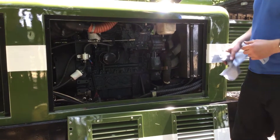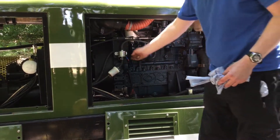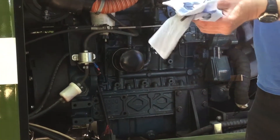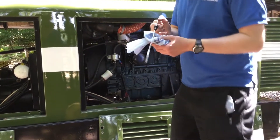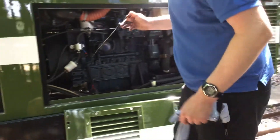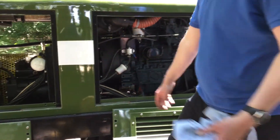Now we're on the left-hand side of the loco in the direction of travel. A bit more to check on this side — got the other side of the engine. Check the throttle cable is all nice and tight and not loose. I've got the engine oil dipstick here and some blue rag to check it. Pull it out, wipe it clean, put it back in, then pull it out again. As you can see, there's plenty of oil on that dipstick — it's between the top mark and the bottom mark, so that's fine. Just other visual checks that nothing else is amiss: no leaks, no damage.